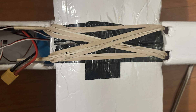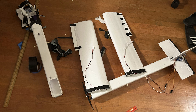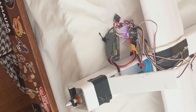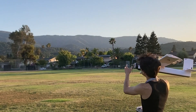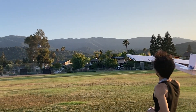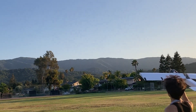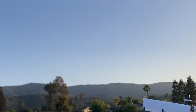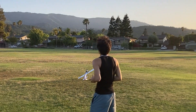Because you can make everything as a separate component and then eventually assemble them — for instance, the tail being a separate section that gets glued on — in a crash you don't need to completely rebuild the whole drone; you can just replace the sections of the fuselage that are broken. Be very sure to check polarity and connections before flight. If you aren't very experienced, you can ask someone who is, or look at videos on YouTube or even ChatGPT. Failures are good — they allow us to learn where a design has flaws and how it can be improved. Though failure can seem like the destruction of hard work, it's really just an opportunity to further improve. Failures are a gift, not a curse.